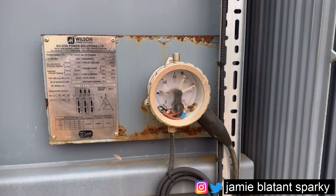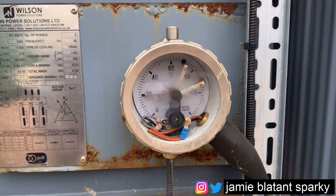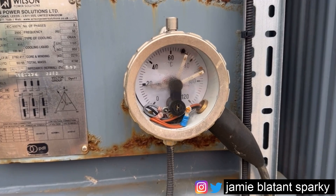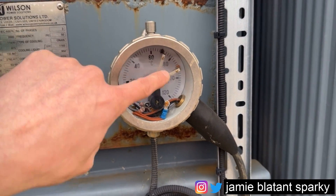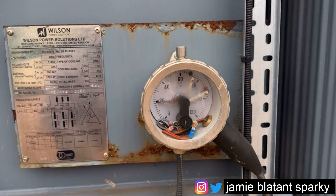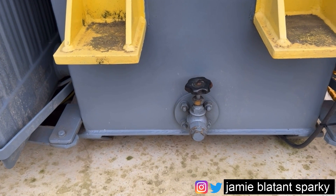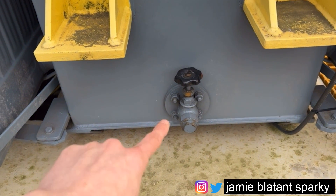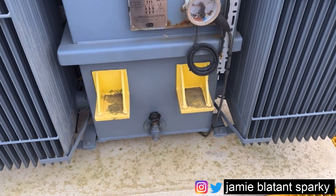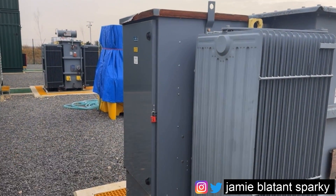Back to the video - you've got a temperature sensor which goes in up there to temperature it. You'll see these little levers in there: one will be the alarm to alert the controls that it's getting too hot, and the other will be the trip. So if it gets too hot it alarms to warn you, and then the next level hits the trip and shuts it down. Then finally down there you've got the oil tap, which should be a brass tap with a bung in it, and that's how you drain the oil out when you're doing sampling or transformer oil changes - something you keep very far away from because if that leaks, it's your fault.